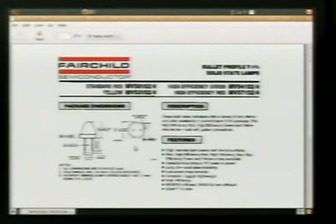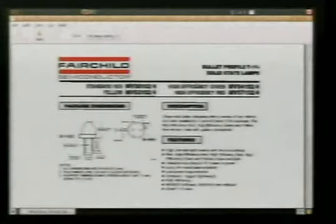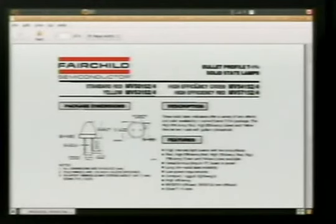What we see right here is the dimensions for the LED. If you wanted to mass produce your wonderful blinking LED, you can draw a CAD schematic and know the dimensions to make the case and the package before you ever made a prototype, if you want to do it all in a virtual environment, because you've got all the proper dimensions. Also notice that up here at the top, this data sheet is for more than one part. It's using the same package type, but it's coming in different colors: the standard red, high efficiency red, green, yellow. So we'll need to keep in mind the different serial numbers when we're looking at a part.